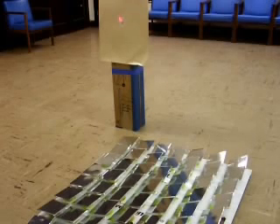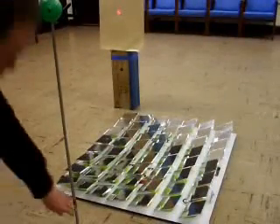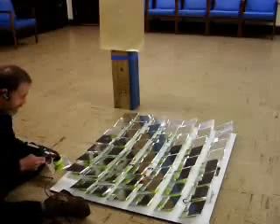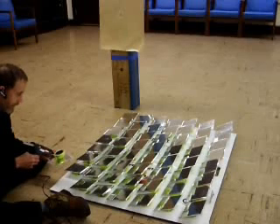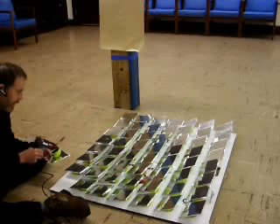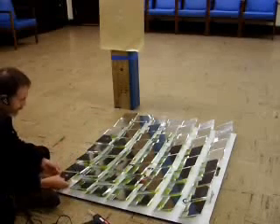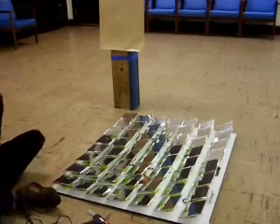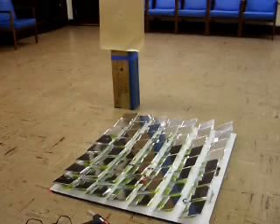I also kicked a whole tennis ball with its mirror off the platform by mistake, so I'm going to repair that too. I'm going to stick some hot glue around the circle at the bottom of the half tennis ball, turn it over, and orient it in its little space there — gently make it stick down on the platform. Then I take my little laser pointer device, shine it on the mirror, and bam — dead straight on the target. So that's the basic manufacturing process for this platform.